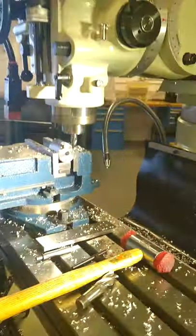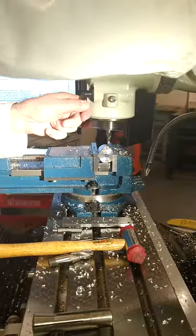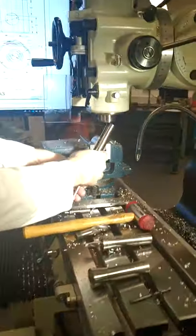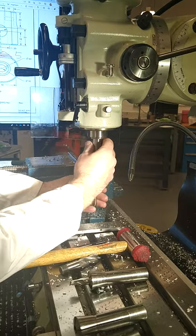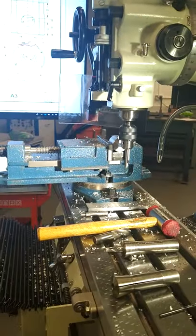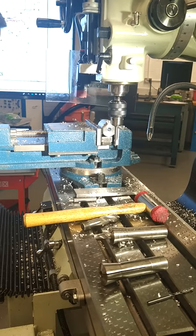So we're going to change out the tool and pop in the chuck. So we need to take out the cutter and pop in our chuck, rotating around so it fits in the white button control. Then wind down the bed again, the knee, so we're just down the knee dial, wind down position.